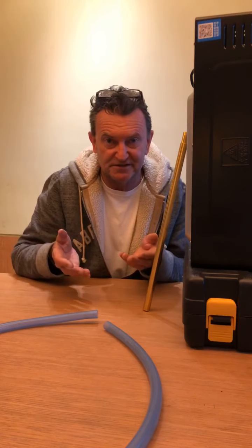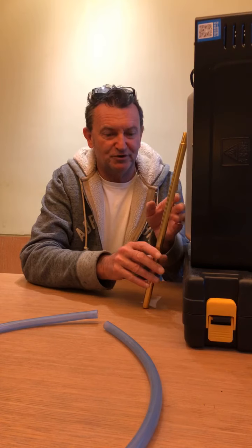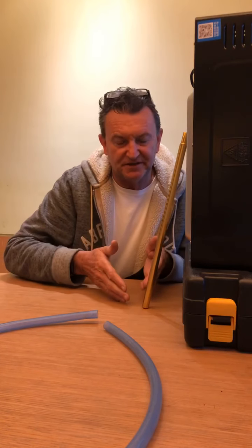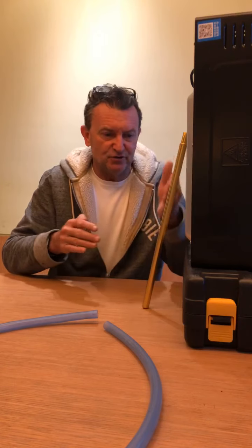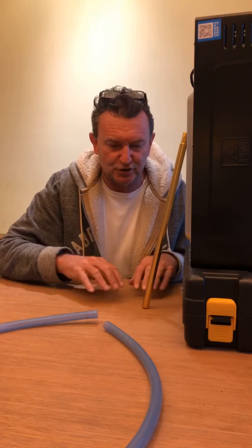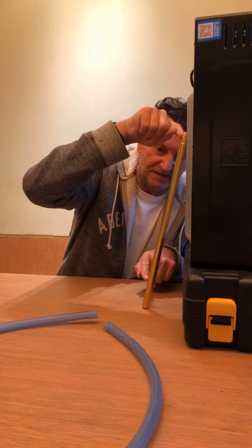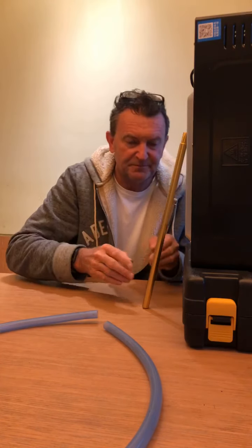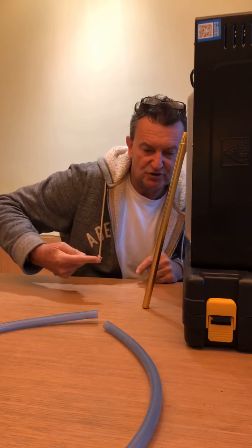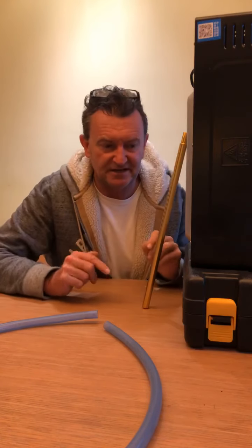Now, if I put it at this angle, let's say, even though those two frictionless surfaces are still the same surfaces, that would be an interesting one, where it wants to rotate there, but that's another pole issue, the desire of a pole to rotate. But now you can see that it's got what's called static equilibrium. The inclined object is now leaning against the wall and being held by the friction, so there is friction on the ground. Gravity is pulling down on the pole or the ladder at this angle, so there are much lesser forces required from this way. So what's actually happening is the wall is pushing back this way, and the friction coefficient on the ground is pushing this way, and so you have an equilibrium, and so this pole is able to stay like this.